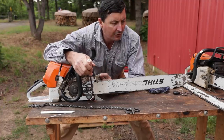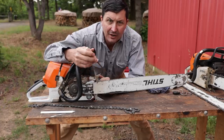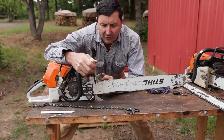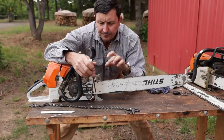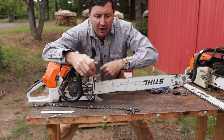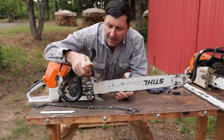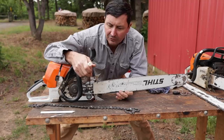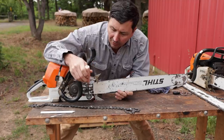Also, a hand filer doesn't typically switch his bar every time because he doesn't need to change the chain. Where the guy that's grinding his files, or you're going into the woods with multiple chains, and when a chain gets dull and he's changing, he's going to take it off, he's going to flip the bar, and he's going to make sure that that oil port is cleaned out. That's really critical and something that happens all the time that guys overlook — and you end up burning up expensive bars.